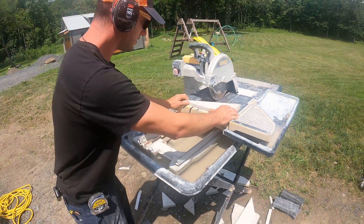This is a 16-inch by 16-inch block and I'm going to cut it right down in the middle. My blade is an eighth of an inch thick, so that means I'm going to lose about a sixteenth of an inch of stone. What I'm going to do first is mark my stone just to make sure I'm tracking it in the right spot. I'm going to mark the eight-inch mark right down the middle and run the center of my blade right on that eight-inch mark. Two stones — seven and fifteen sixteenths. I'm going to put the cut edge to the outside.